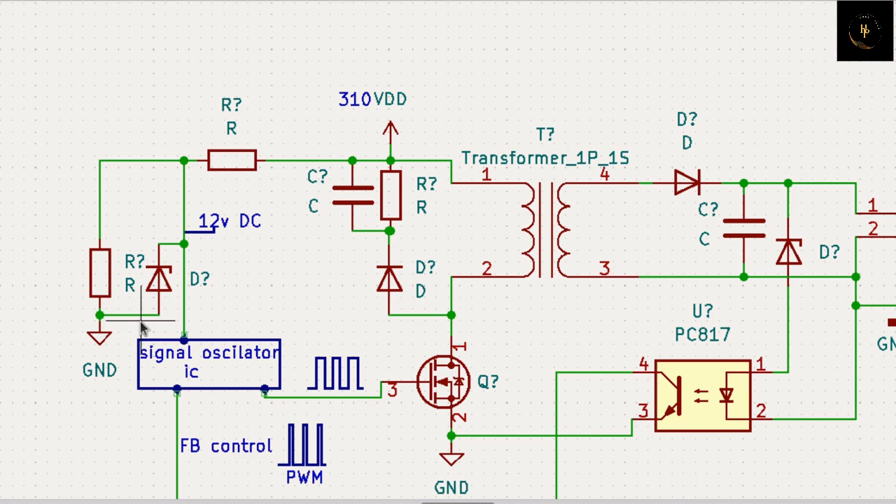If you tell me - then why do you put this resistance network here? Because if I don't put this, all voltage goes through this zener diode to make it 12 volt - not only that, it will be burned out. This resistance protects the ampere, and this resistance stabilizes the voltage.